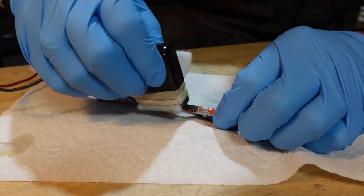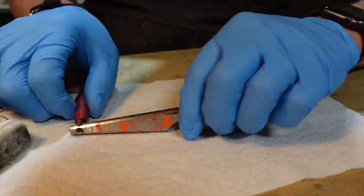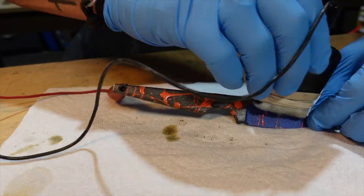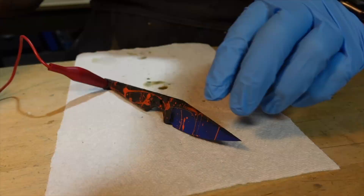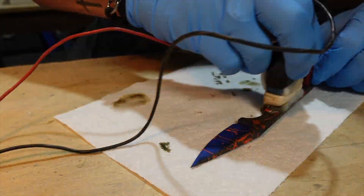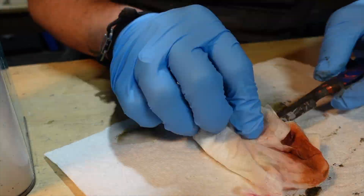It will slowly eat away at the metal. I ended up doing this for about 10 minutes on this blade at 20 volts — that'll give you an indication. If you're using a nine-volt battery, it might take an awful long time, and this also isn't a huge blade. It was also kind of difficult to know how far to go because you can't see the difference in the material when the nail polish is on there.